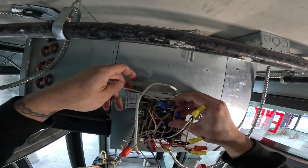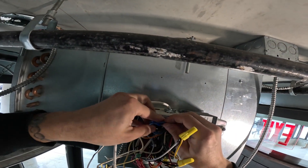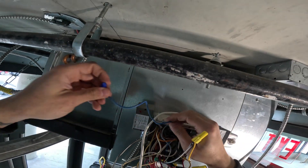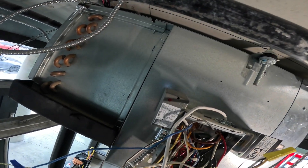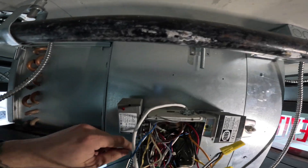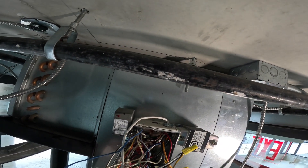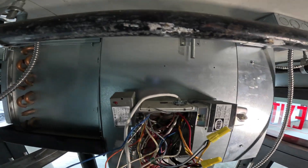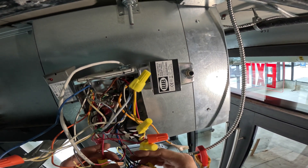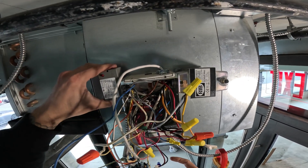White and black is if you're using 120 volts for the coil — you're not using that, that's normal. Then we have a solid blue wire, which would be your normally closed contact — that's not being used. So we should be using orange. Orange is right here. Orange and then yellow — yellow connects to two red wires. One red wire goes to the actuator, and another red wire goes to what I'm assuming are the fan motors. So that one relay is turning on both of those things.